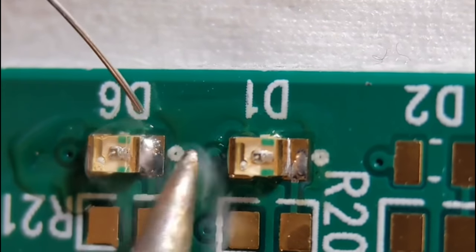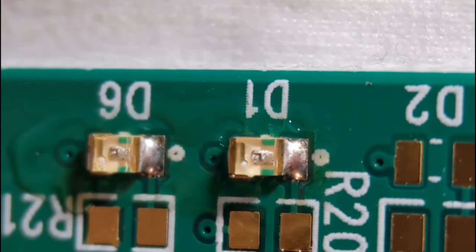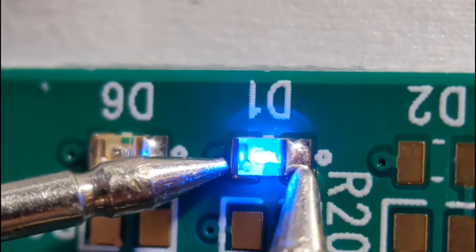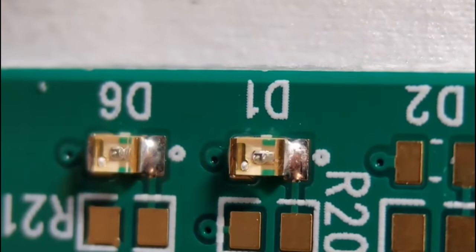You don't want too much solder on these - just watch the potted body on the top. After fitting I tend to light them up just to make sure I've got the right polarity. I'll give it a quick clean to get the flux off, then light these up to prove I've got them around the right way. As you can see, both are lit, so they're around the right way.